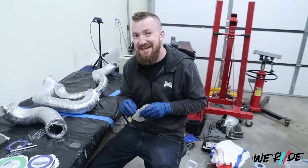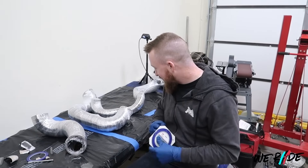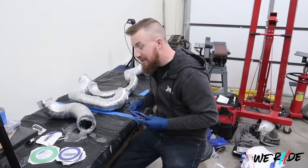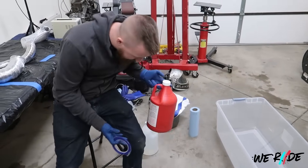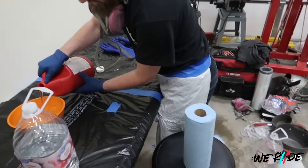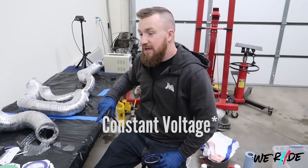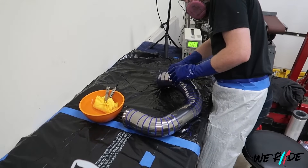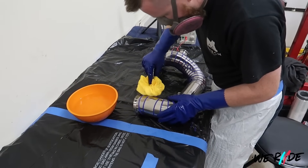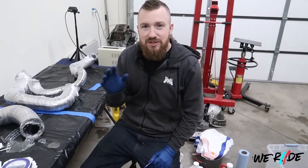Well, first things first, it takes a lot of time, a lot more. Because normally when everybody does it, you just use heat, right? It's what everybody's seen. You just take a blowtorch, you heat it up before, after you weld, whatever, and it takes like 30 seconds. What we're doing is we're taking little bits of acid — this right here is actually drain cleaner. We take like a tablespoon of it and mix it in with about half a gallon of water. And we have our little electrical anodizer. Basically all it does is it holds a constant current all the way through. We hook one end to the pipe, we take the other end to a sponge that gets dipped in the acid, and then we just rub the acid on top of the piping while it has an electrical current going through it. And the voltages that we do is what makes the colors.